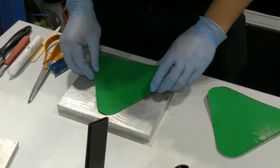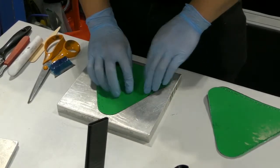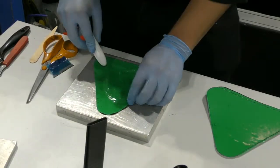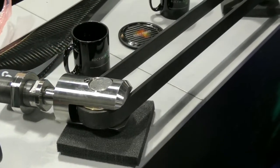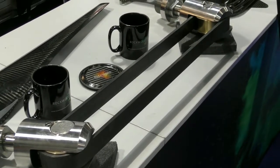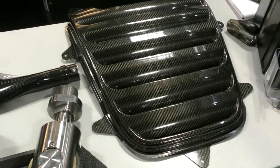On the other side is the compression moulding side. These can be monolithic composites where it is solid carbon or glass all the way through, or have some honeycomb or foam structure inside. These parts are net edge moulded around all surfaces, so every side of the component has a tooled surface. And it gives a lot of control, a lot of freedom, a lot of detail that you can put into a part straight off, without having to bond two pieces together.